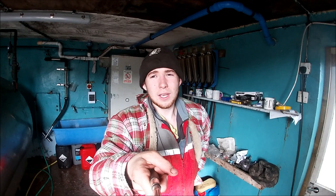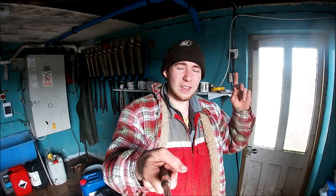And then another 75 kilos in the middle, which gives us around about 275 kilos in total — more than enough to keep the tines in the ground. The weight is really there so the tines just spike in that bit more, because we found before when we used it without any weight, if you hit a hard spot in the field the tines would lift themselves out of the ground and it's not quite as effective. So we'll get this last drum loaded up and head down to the fields to start aerating.